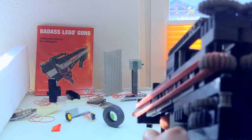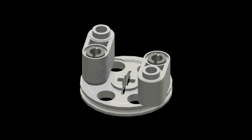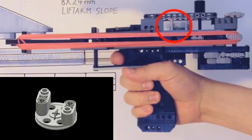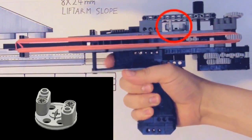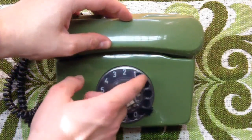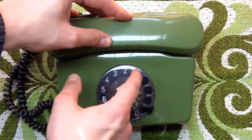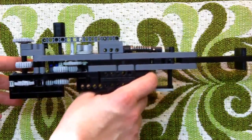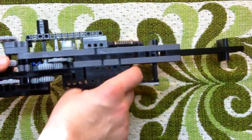How does it work? The central mechanism of the Melody is this little piece — a centrifugal brake. That's a brake that raises friction the faster the axle spins. The same thing works inside rotary phones: turning the dial slowly is easy, turning it fast is hard. The same applies to the Melody — this mechanism makes the gun fire at a constant rate.